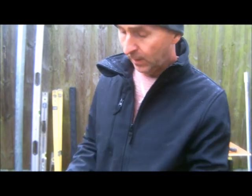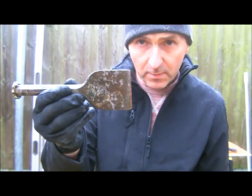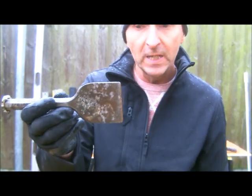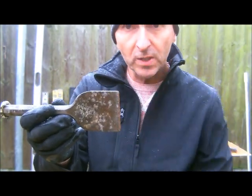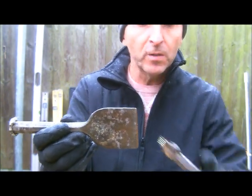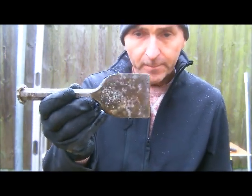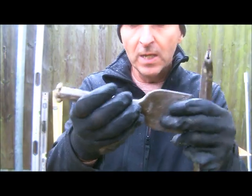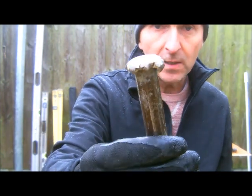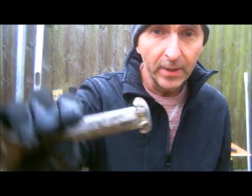I only ever use a little 60mm bolster for cutting bricks. When I cut blocks I'll use a saw, and a 4-inch bolster for brickwork is too big — I found that you'd end up losing the corners of the bricks a lot. So the 60mm is ideal for bricks. Be careful to keep the ends trimmed — you can see the burrs on this one. Those can fly off like miniature bullets.